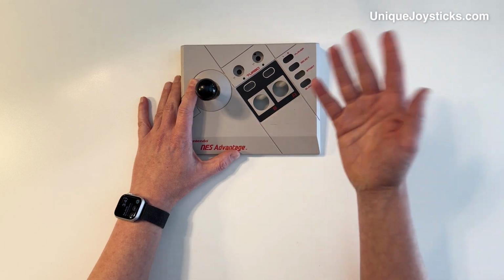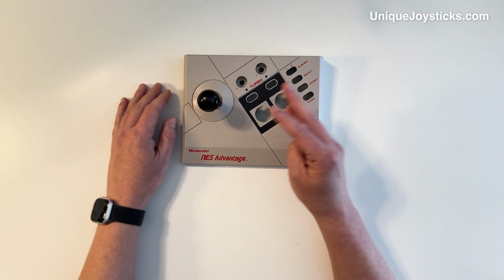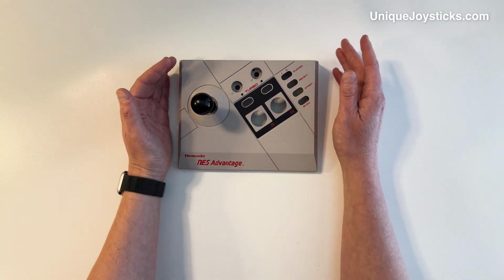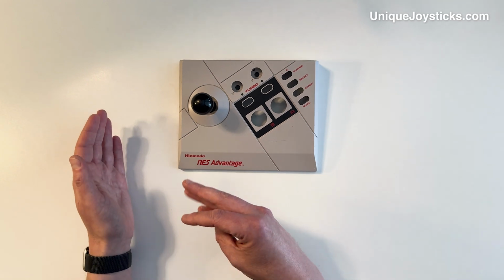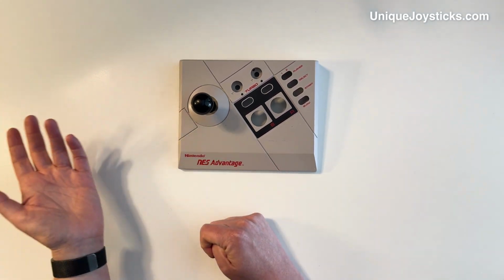This secondary button on a Commodore 64 could do lots of things. It could be that 64GS function. It could be the up on the joystick. It could also be the same function as the space bar, which is wired to the fire button on the other port, the other controller port.